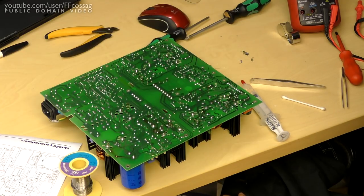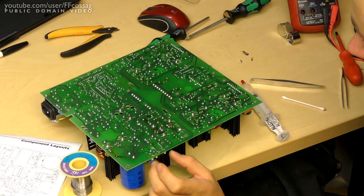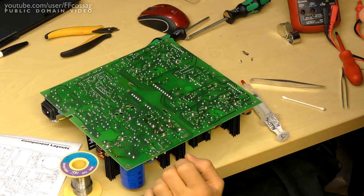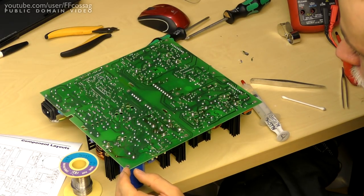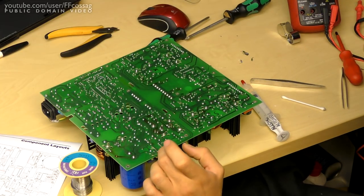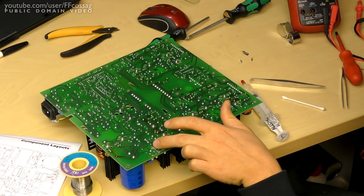Oh dear. This has very quickly turned into an absolute mess. So I've started digging into the whole circuit area and pretty much every semiconductor and resistor around here, save for a couple of diodes, is blown. It's all congruent with how you would expect it to fail if you had a sudden voltage spike on the point we saw.